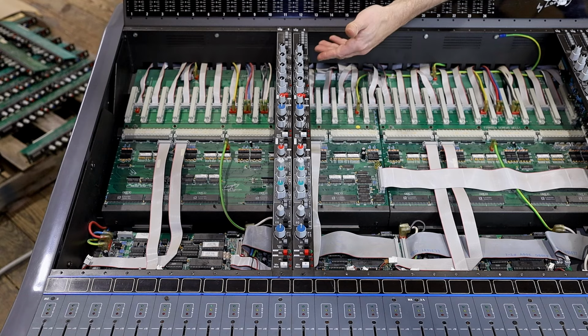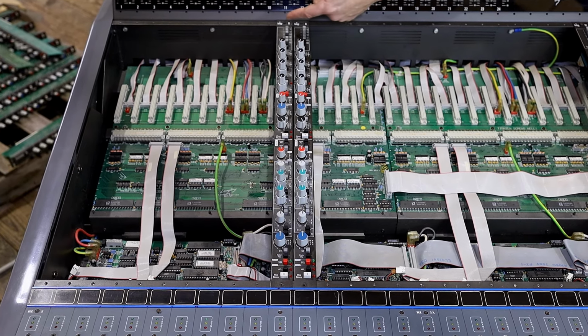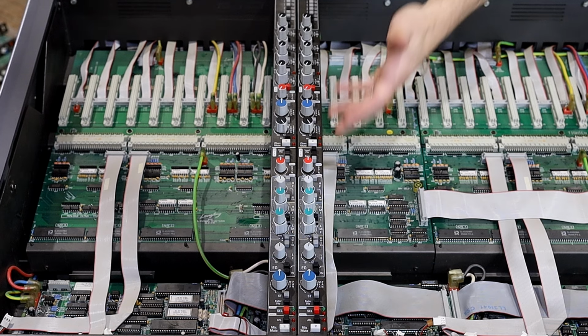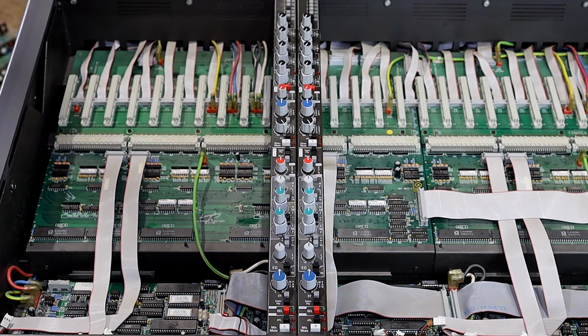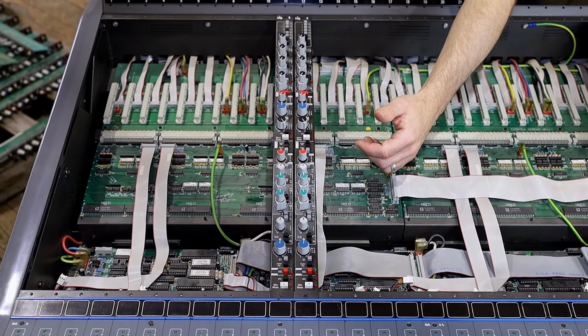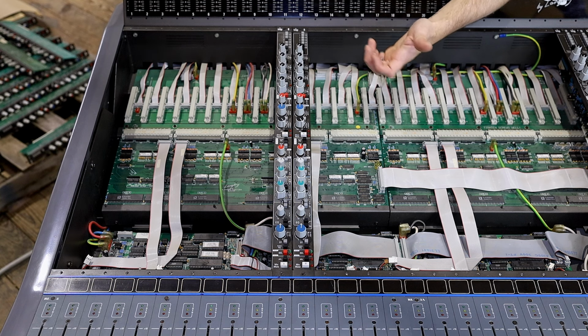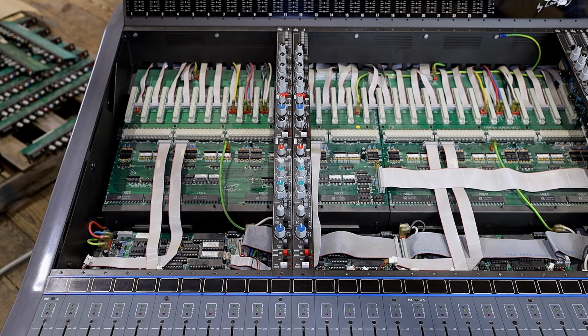This is our channel 12 that has now been cleaned side by side with channel 11, which is stock and not cleaned. Channel 12 has now been fully recapped, and as a direct result of that and cleaning all of the pots and switches, you can hear channel 12 has come back to life. It now works perfectly. It sounds really gorgeous, actually. I have the gain turned all the way down. Hear how low noise it is. I was pretty darn sure it was those caps.